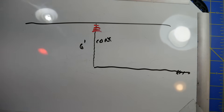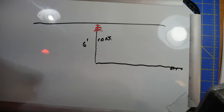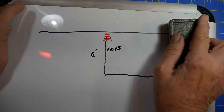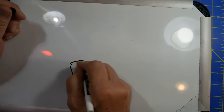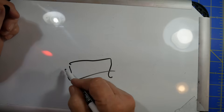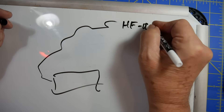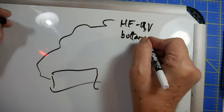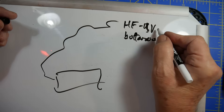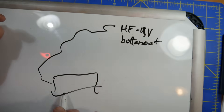Another thing — and since he makes no mention of it — is grounding. What does he do for grounding? I've had a situation where the addition of a ground made a big difference. I had a radio with a coax going out to an HF9V, a Butternut vertical. It was grounded really well, and I had all this coming back in with S9 noise.